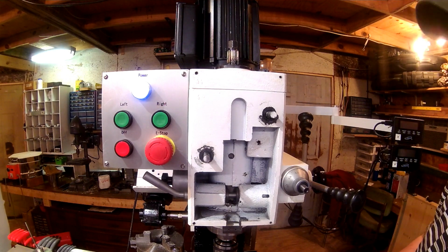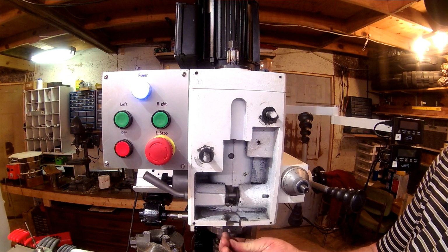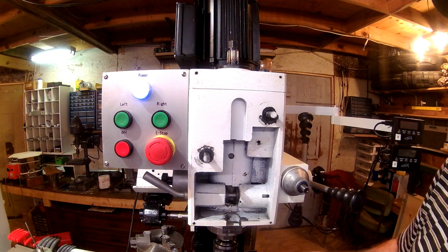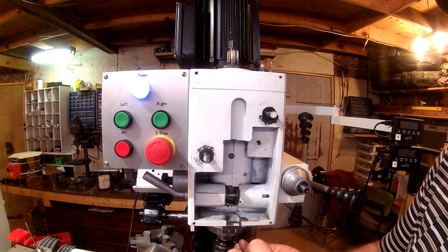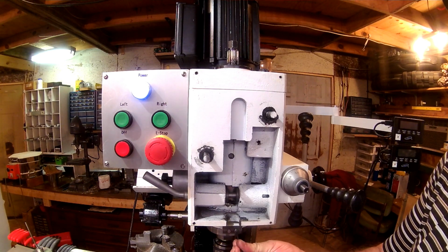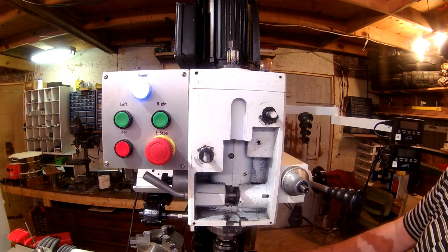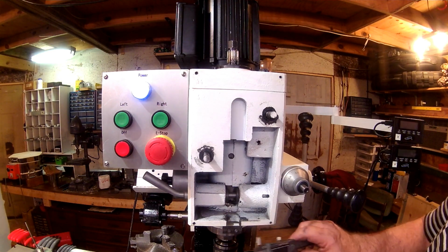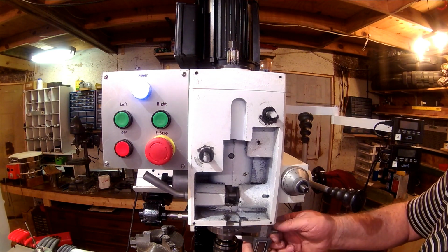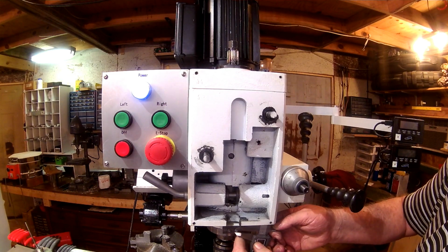And just a quick, I'm sure most of you are aware of this, but a little trick when you need to match a hole pattern, of how you can use your digital calipers to find that distance between there. If the holes were big enough, I could use the inside measurement on the calipers, but since I've got screws just alike here, what we want to do is on our digital calipers measure the width of one of the screw heads.